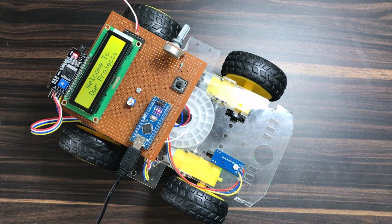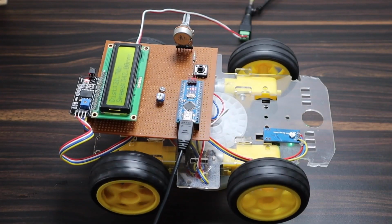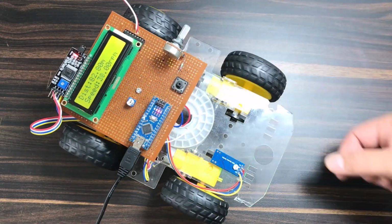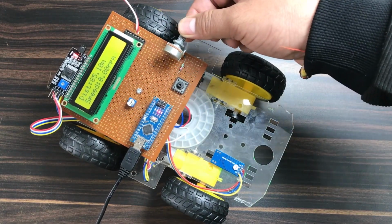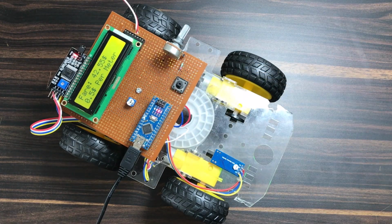In this project, we will build a prototype of a digital taxi fare meter using Arduino and a speed sensor. This project calculates the speed and distance traveled by the taxi's wheel using the LM393 speed sensor. The LCD display will display the speed and distance traveled continuously. It also generates the final fare amount when we press the push button. So, let's see how we can build this.